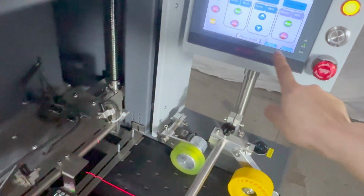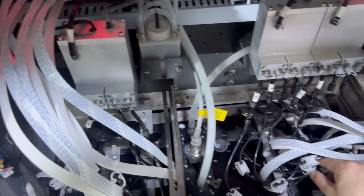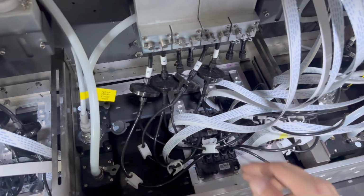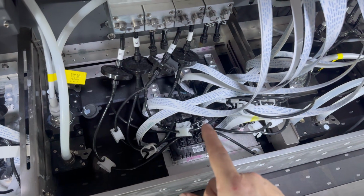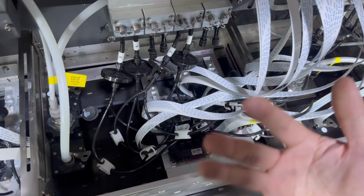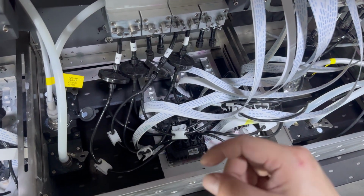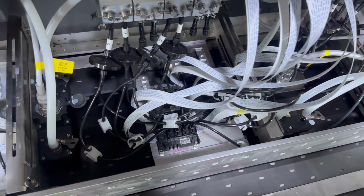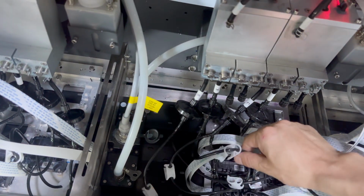Then we first stop the belt. And we go to the printing head position. We can see here we find some problem. So for the missing channel there are two solutions. First, maybe the printing head got clog. Number 2, maybe the ink channel is not going through, it's closed. So we check the first printing head, the second printing head, is closed or not.